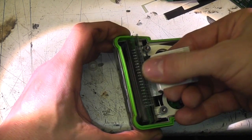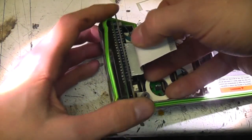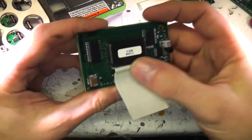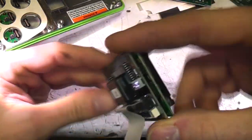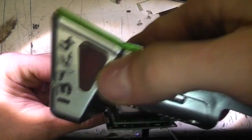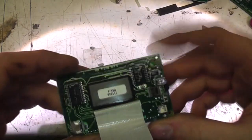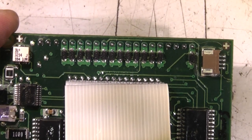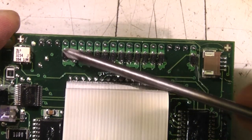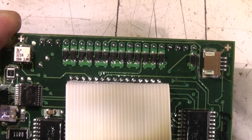This flex goes up to the display board. There's a little flex for the membrane keypad for the buttons. So this is just an LCD — there's an interesting little box there. There's also an infrared transmit-receive pair that goes through the side — that's obviously a data link to provide probably data logging, maybe some calibration and test functionality. Something I've just noticed on this display board: every single pin of the LCD has two diodes on it. Again this is another intrinsic safety feature.